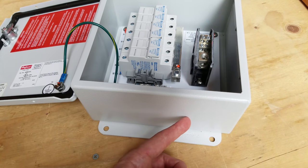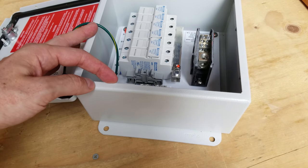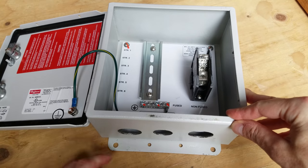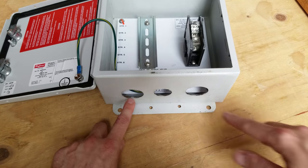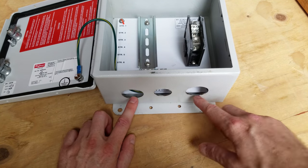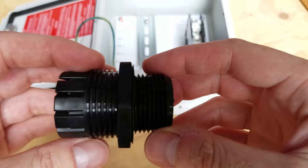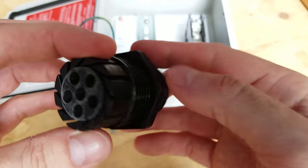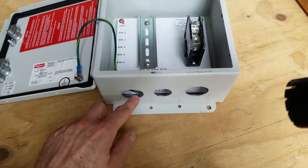There are no pre-punched knockouts in this enclosure — that's actually a good thing — however the steel is very thick and it was somewhat difficult to punch knockouts through. Here's the second enclosure with the knockouts already punched: two 1-inch knockouts on the left and right, and a 3/4-inch knockout in the center. The PV inputs come in the two side holes, and the center is the output to the charge controller. For the PV input I picked up strain relief bushings off Mouser — they have 6 holes you fish a wire through, and a gasket that forms a waterproof seal with the enclosure.